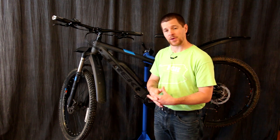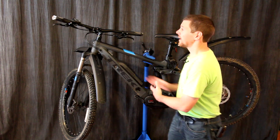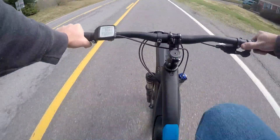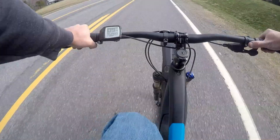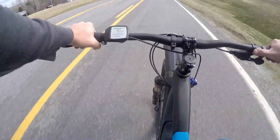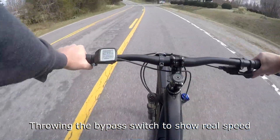The way this is done is by putting a microcontroller in between the speed sensor of the bicycle and the cycle computer up here. Once the bicycle reaches 19 miles an hour, the microcontroller takes over and cuts the speed in half. So once you exceed 19 miles an hour, the cycle computer is going to read half the speed you are going. However, once you reach 40 miles an hour, this is going to read 20 miles an hour and the speed limit will kick in again.